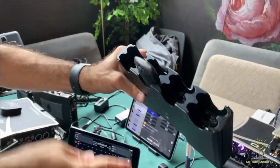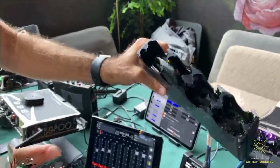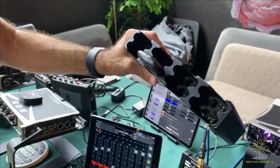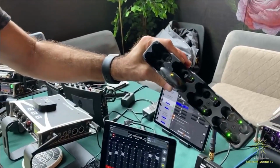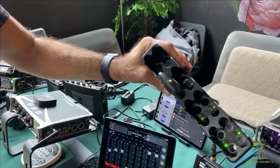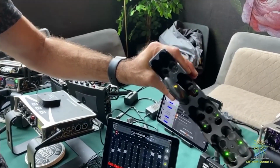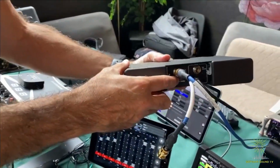So at the start of the day, just plug in your BNC timecode source. It'll jam all your transmitters, and then they'll run all day. The other thing this can do as well, if you're using the record feature and you need to transfer all those recordings to a computer, then there's a file transfer port here via USB-C.